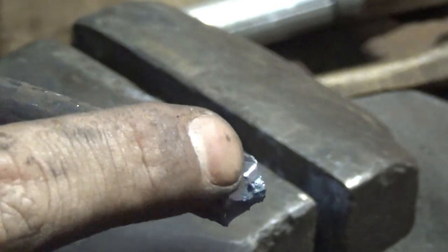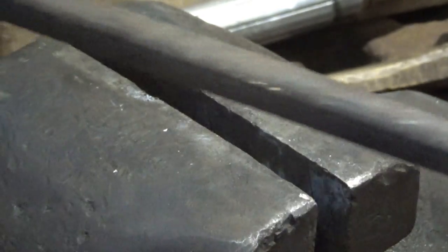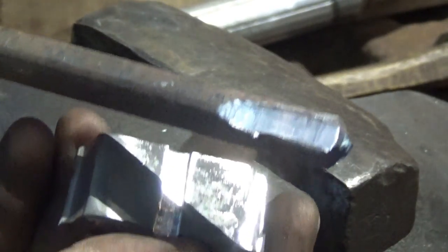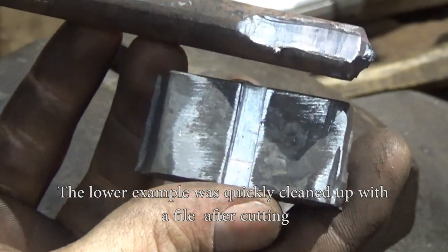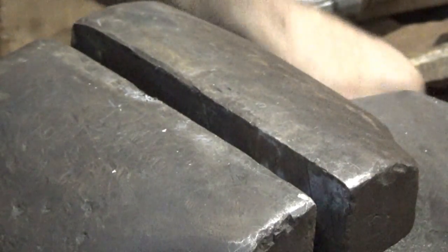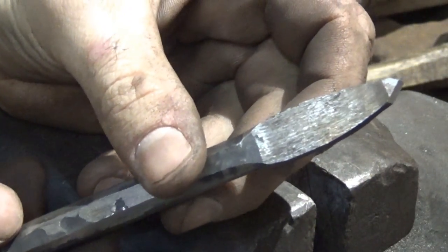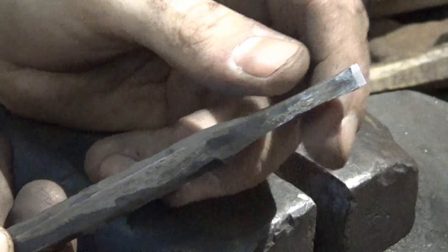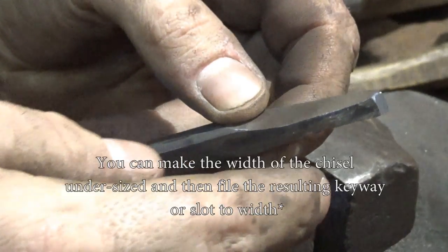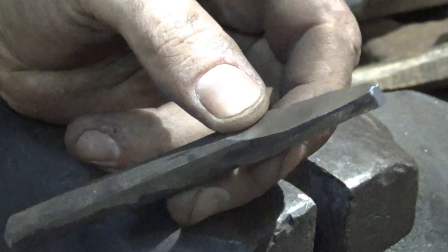A little cleanup with the file — take the burrs off the corners. That's what you need to do with the chisel if you're feeling fancy or your work is particularly clean. Cape chisel — it's a super useful tool. And if you saw my previous video, you know it's pretty easy to make one of these. You can make them any width you want and build your tolerance into that. So if you want a quarter-inch slot, you can make this a little shy of quarter inch and then just file it to your dimension.